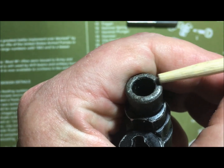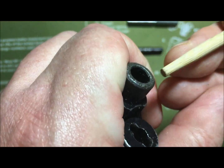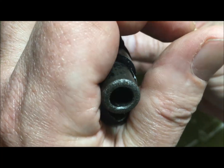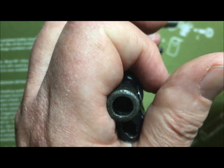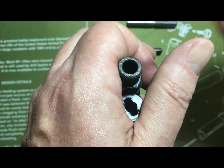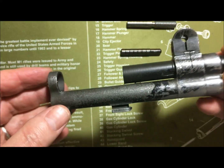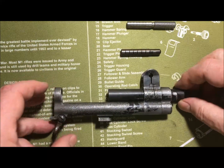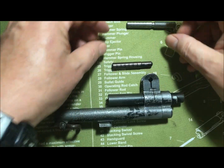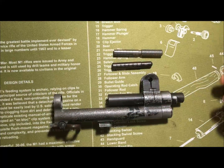As it is, there are some nicks right in there on the muzzle of this barrel that would affect its accuracy. At least it would affect accuracy at distance — inside 150 yards you're probably okay with a barrel like that, but you should clean it up.